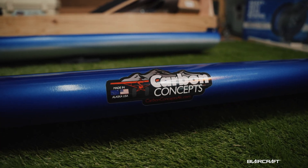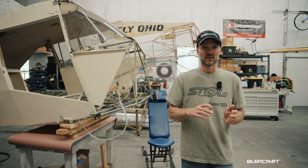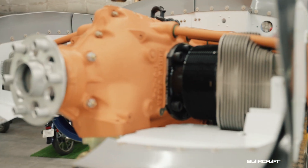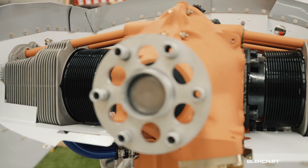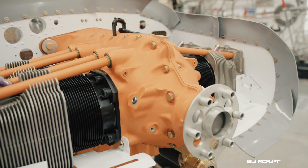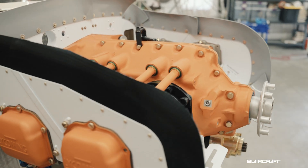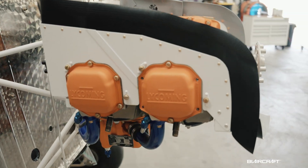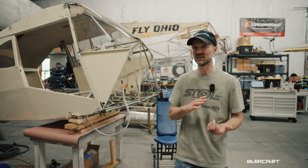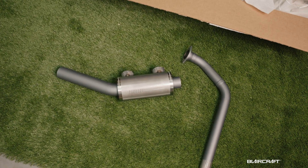The slats are actually metallic blue — they're not all painted yet but they've got a good start. Next is the O320 B2A 160 horsepower engine upgrade, which is probably the biggest upgrade by far. We're going from 108 horsepower to 160 horsepower. On top of that, there are bored and polished cylinders, and the Vetterman exhaust is going to bring back even more horsepower that's typically lost.